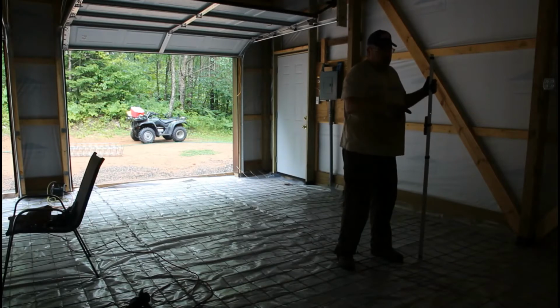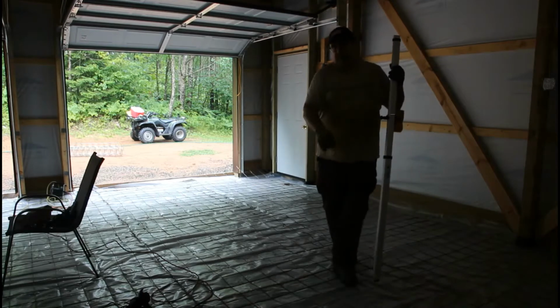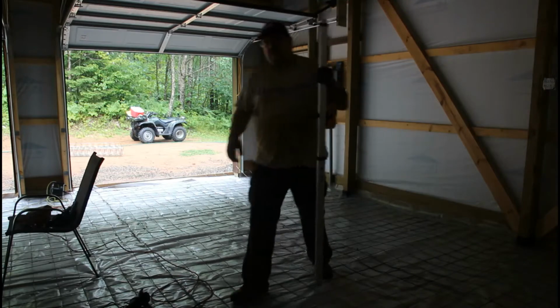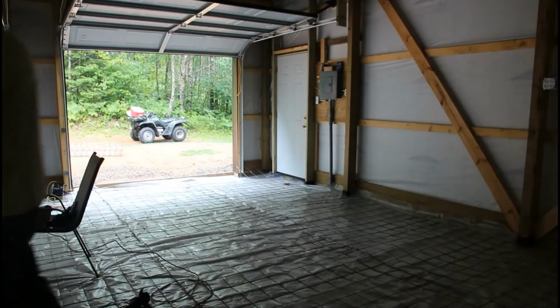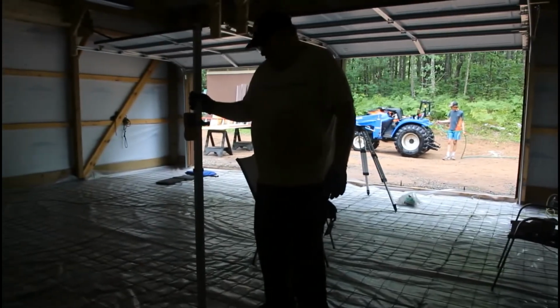So the reason we're going to do it like every 8 feet is because then you've got overlap. So then this will be done on this first section. So we won't have to set any more here, but we'll have to set the next pad. I got you. Here. Or wherever, yeah. So it's right there at the top of the concrete.